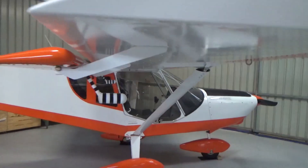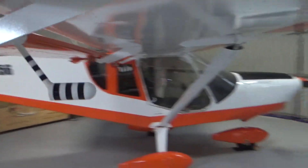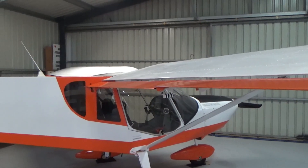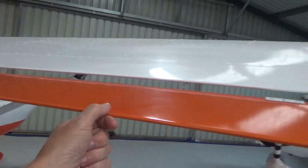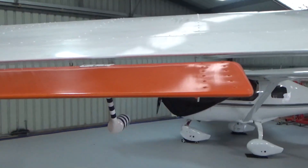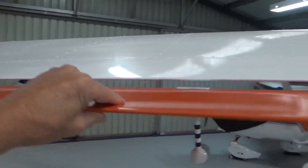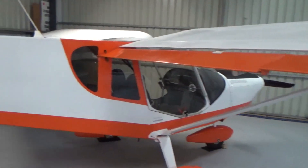Wing tips holding up well — the plastic wing tips. My counterbalancers, all going well. The aircraft, as I'm getting used to it, now seems to be rolling very slightly to the left — the old heavy left wing. I might go along and squeeze the trailing edge and see what effect that has. I could also put a little bit of rubber-type trim on there. It's going left, so this one has to go up — a bit of trim on the bottom. I'll report on that.